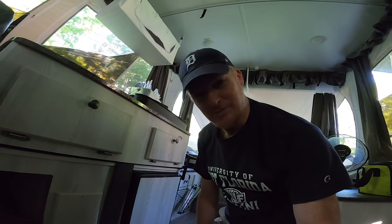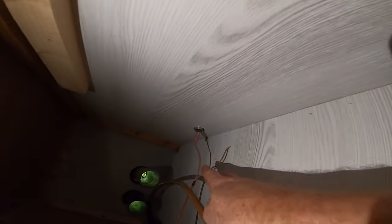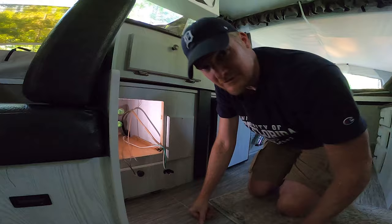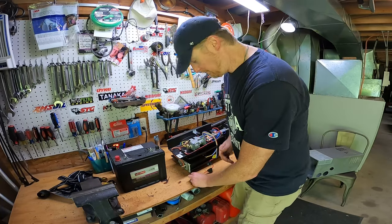The furnace is fine, the thermostat's fine — it's just a disconnected wire. This wire is completely disconnected from that switch. If I connect that, it'll have power. This is great news because reattaching a wire is cheap. I had disassembled it last year, reassembled it, tested it, and everything worked fine. I don't know how it got pulled or tugged or disconnected, but it did — I'm sure it was my fault somehow.